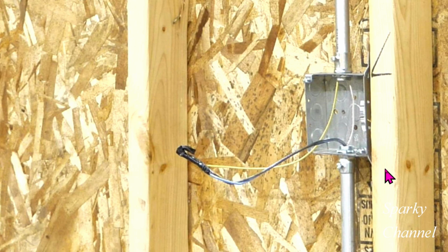Now, something that he just did, he had a loop coming out here with the white wire, which I was very happy to see. It's so much easier when you go back to replace a standard three-way switch with a digital three-way switch that needs a neutral wire. It's so much nicer to have one that's pulled out to proper length, and you cut it so that each piece of this will be at least 3 inches outside of this box, and you can work with it.